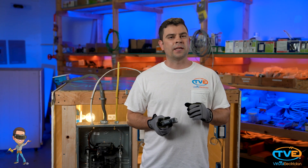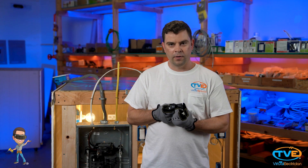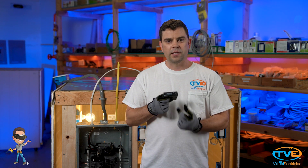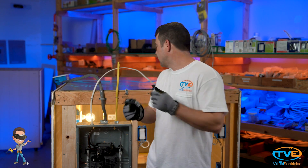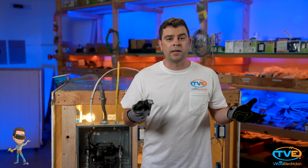This video is dedicated to my buddy in Chicago who recently had this problem. He experienced a fault in his circuit that tripped his breaker. He went down to the panel and tried to reset it — what he did was just push the breaker forward. When you do this, it looks normal, it looks like all the other breakers. Sometimes when you push it forward it stays forward, but the problem is you really haven't done anything. If you notice the breaker is kind of mushy or loose, as he described it, it's because the breaker hasn't been properly reset.